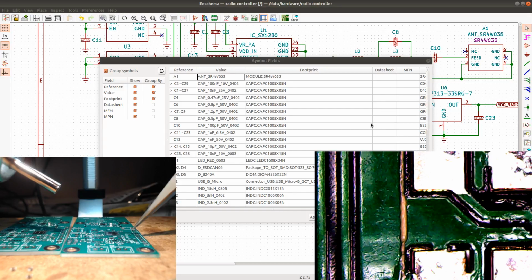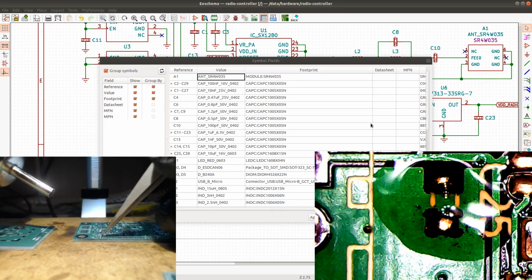Good. And then we can place the capacitor. Okay. Oh, come on. Good, like that. Excellent. So when it has a good joint, it doesn't fly away anymore because it's kind of sucked into position. Make it a little bit less airflow. Yeah, good. Okay, so moving on to the next.